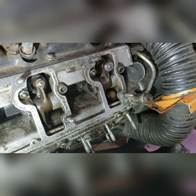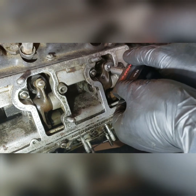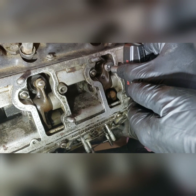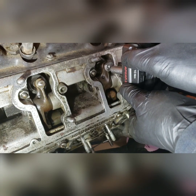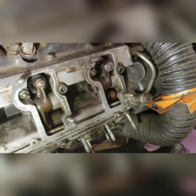After that, take the two millimeter hex key and turn it three quarters of a turn, or 270 degrees, to lock the collar to the adjustment screw. There's 180 degrees, and that's 270 — that's all you need.